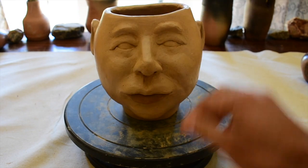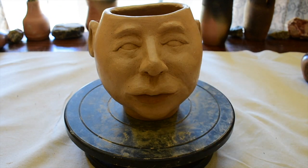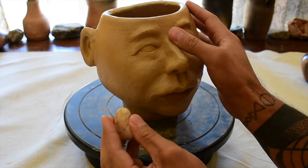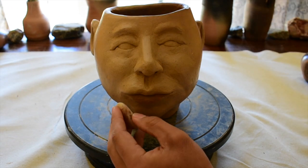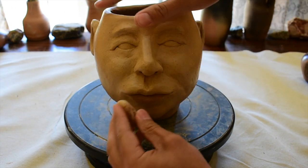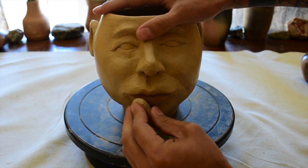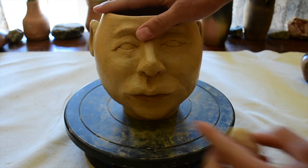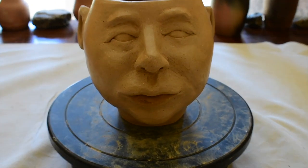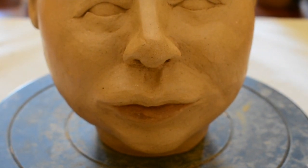You can tell the color difference when it has moisture compared to when it's bone dry. With that moisture still in it, that's when you want to catch it for burnishing. You can use any stone that is smooth and flat without a lot of grit or divots. As I start to put pressure on the lip, you can see how it changes color — it's getting even more compact.